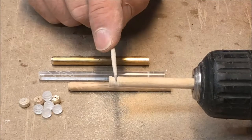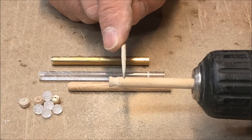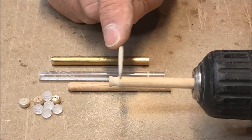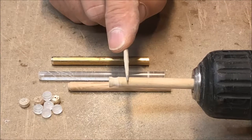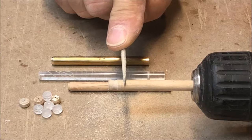So there we have one side. Now whatever the width of your mortise is — I use about a hundred thousandths, about the width of my wheel tread — I want to move over a little bit and then we'll create the other hub ring depression.